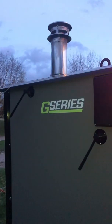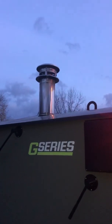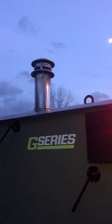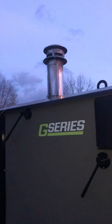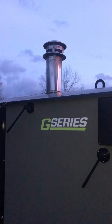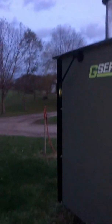And it's just starting to gas. About eight minutes now since I put the torch to it — zero smoke. I would highly recommend this method if this is your first season with a gasifying stove. That way, right off the get-go, you know how it should be running when you have a cold bed. There's no question about whether you started it properly.